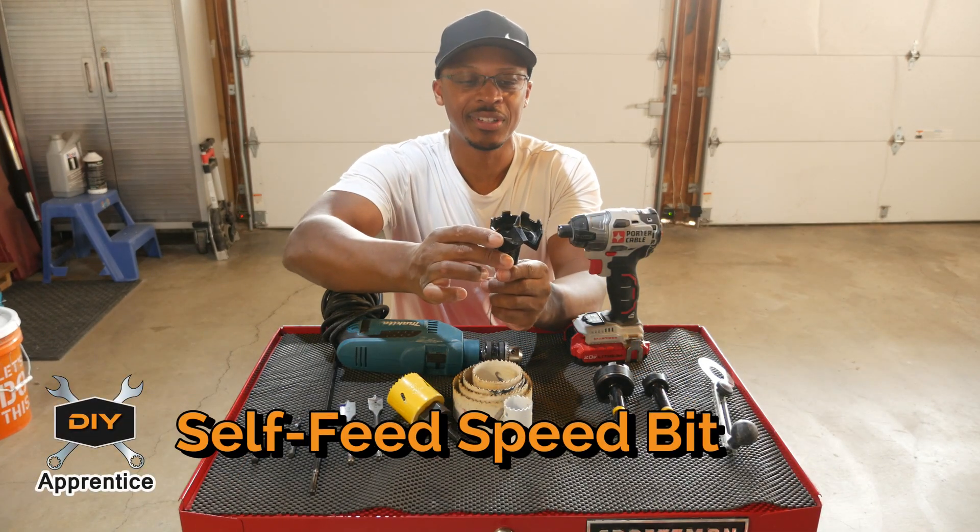The last device is a circle-cutting attachment for my Dremel that goes from four inches up to twelve inches. I've mainly used this for making holes in drywall or backer board in the bathroom, though you could also use it for cutting holes in plywood. So that's the progression: started with drill bits, then spade bits, then hole saws for larger holes, then self-feed speed bits for plumbing through multiple studs, and the Dremel attachment for larger circle cuts.